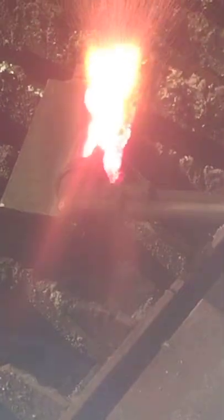But be careful right there, that end. Find my separation, there's my separation. Now I'll get that weld back up off of it. Give it some more oxygen. Then I'm going to come back and find my separation. Notice how I'm getting further and further away as it cuts down toward that bottom plate. I'll run that separation while I've got it.